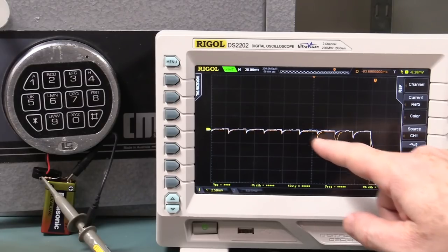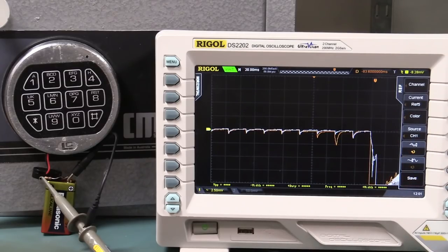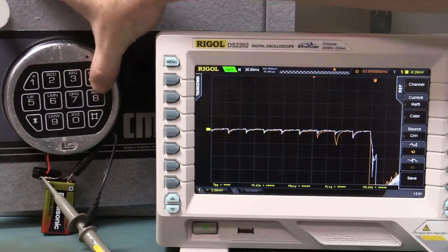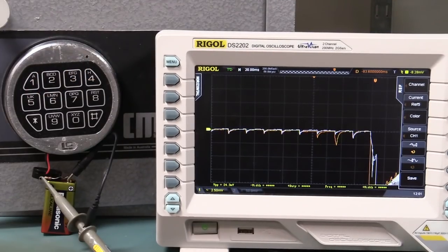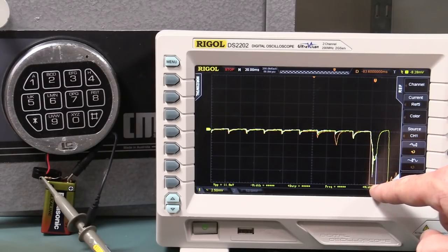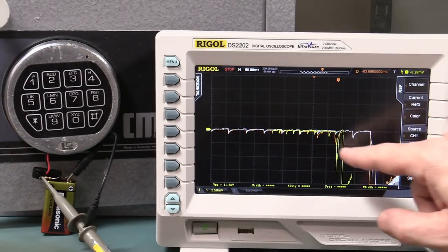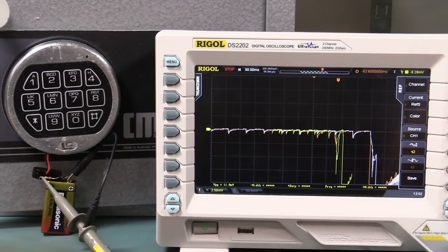All right, so our orange waveform in there is the correct one, in the correct sequence, and that white/grey one there is our incorrect sequence. Let's verify that incorrect sequence again. So I'm going to go, I don't know, 8, 2, 3, 4, 5, single shot, and 2, something like that. There we go. Hang on, no, this has gone back up here instead of going back down there like the other one. So something, once again, has changed. We've got this huge spike there, which it didn't go all the way back up before. It sort of started going down there.